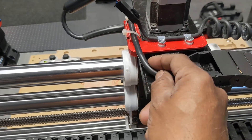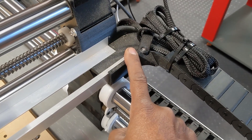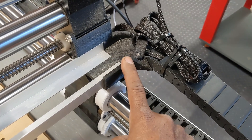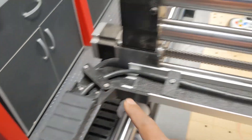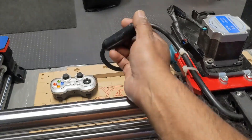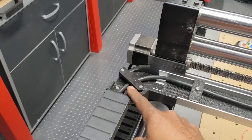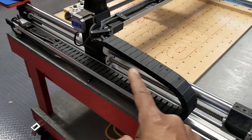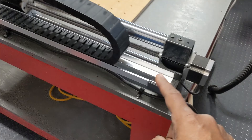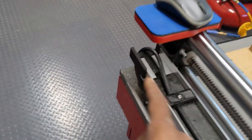To avoid any EMI in the future, I wanted to isolate my power cord. So what I did is I took the elbow and I mirrored it. These 3D printed files I got off YouTube from Kevin M — really great design, I'll put a link in the description for those. I mirrored that in Cura and put one on this side. I flipped this drag chain around and all I have is the power cord coming through here. I've got a ferrite core in here too to help reduce noise. Then it comes down here across to here, and I bought another drag chain — another Y drag chain — just for the power cord. I mirrored the Y brackets here with the aluminum channels.